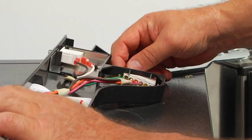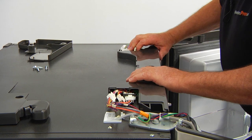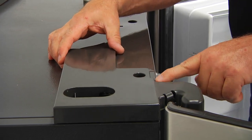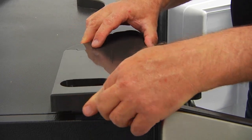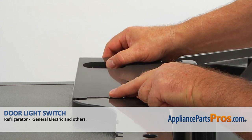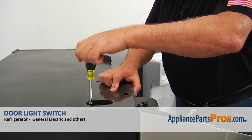Now we're going to install the plug into the bracket — we need to push it into position. I'm going to flip it over and align the holes. Next, I'm going to bring the hinge covers and install them — place it on and interlock this with the central piece, slide it in, and push it down. It's installed. And now we're going to take the right side and bring it in, slide the interlock, and press it down onto the hinge. Now I'm going to secure these three pieces with quarter inch screws.